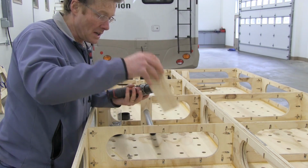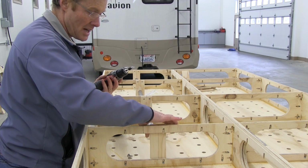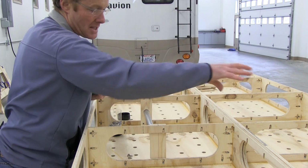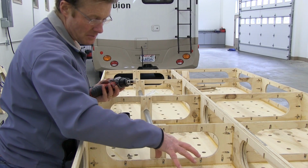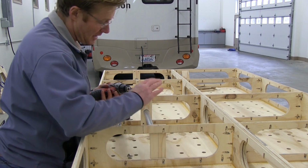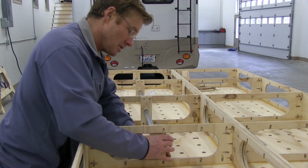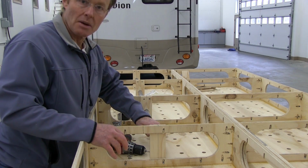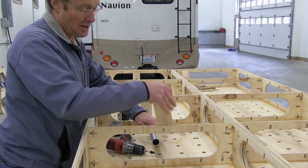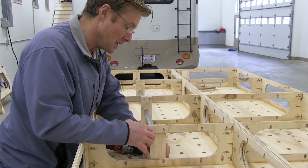The stop block, instead of going on the same side as the guide blocks, I'm switching sides because the router drops in on that side, but they'll be laid out the same. That drops in, and we use this bay here, so I want to keep everything to do with the pipe out of it. I want to keep this bay free and clear. Plus the fact that you're going to be pushing force against it, so this way you're driving into there and not pushing against the screws. So it makes sense to move it even if we didn't need the space.